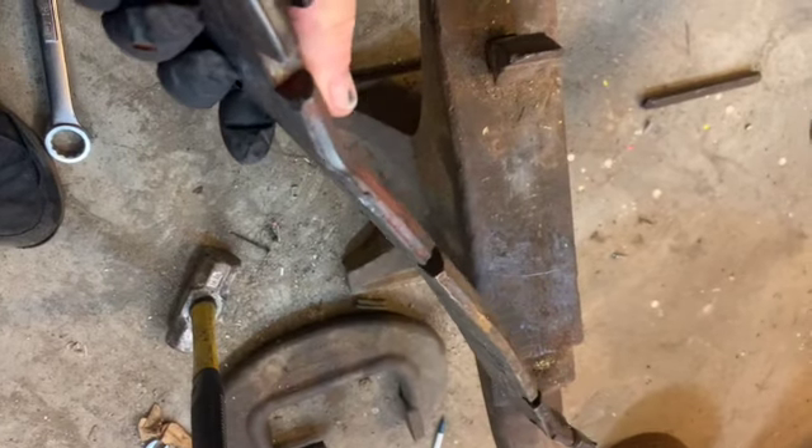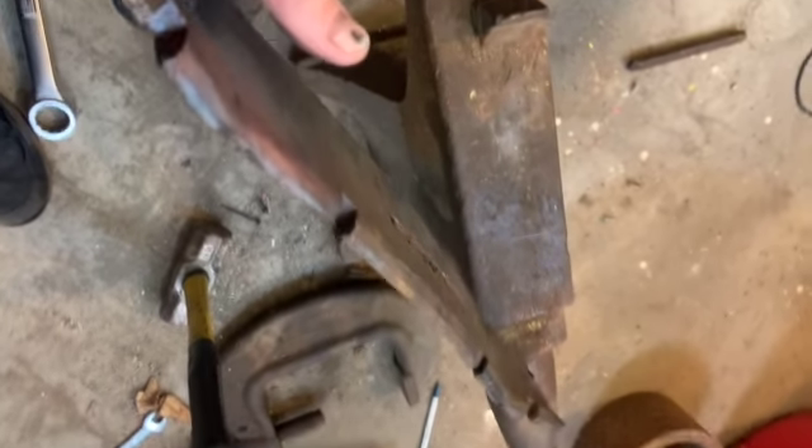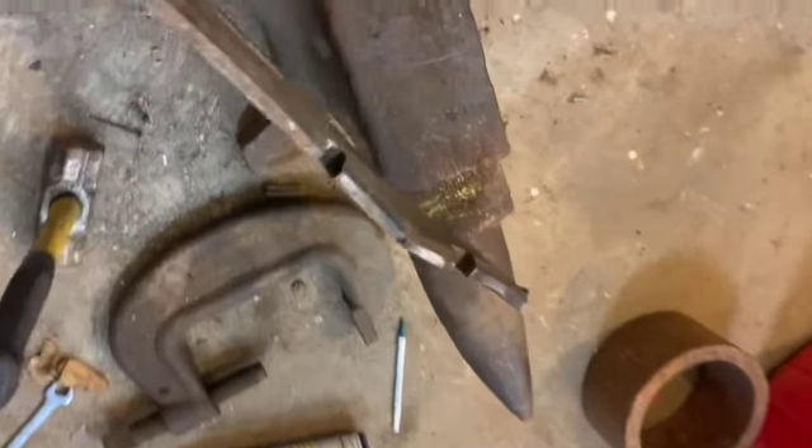This is the piece I cut off. It's a little too bent and it's five-eighths thick, so I tried straightening it, but it won't straighten. I got it cherry red and it still ain't going to be too good, so that's why we're replacing it.